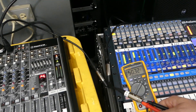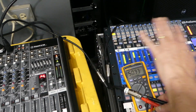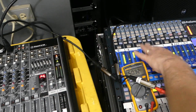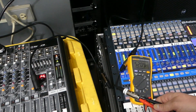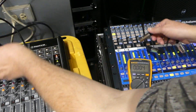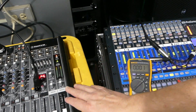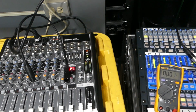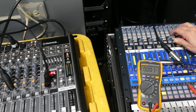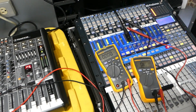We got 50 volts — a little less than what one console puts out but a little more than the other. There are no issues with this whatsoever. This is how larger shows run with separate monitor and front-of-house consoles. When we unplug one side it goes right back up to 52. There's really no issues running phantom power between a monitor and front-of-house console, but in our system we just choose to use the monitor console to provide power to all the microphones — no sense running it on both if you don't need to.